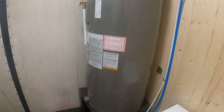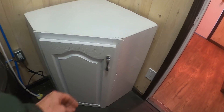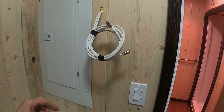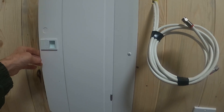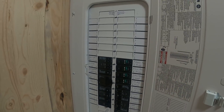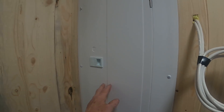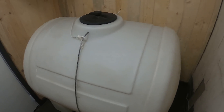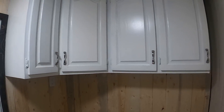This is the utility room at the end of the trailer. There's a 40-gallon hot water tank and a storage cabinet with lots of storage. There's the coax cable wired in — for a satellite dish or whatever — which runs through the walls to the plug in the living room. There's a 100-amp fully labeled panel with lots of room to add circuits. Underneath is the pressure system — an on-demand pump that goes up to 60 PSI. We didn't put a pressure tank in to save storage room, but it works very well. There's also a 200-gallon fresh water tank with wall cabinets above.